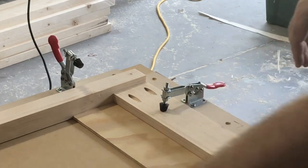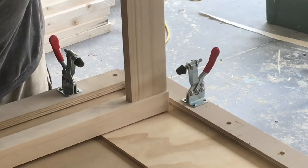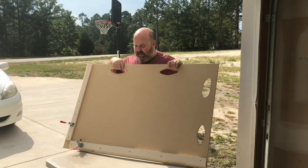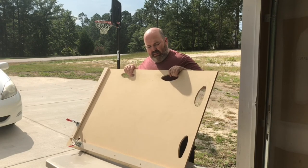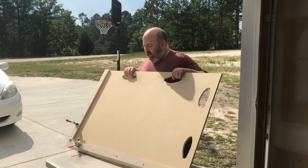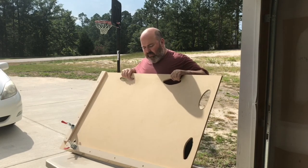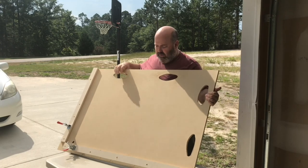Really, this jig provides all kinds of possibilities for holding assemblies together, being able to secure a 90-degree corner without constantly checking with a square — and it's not just for pocket hole jigs. There you have it: an assembly top that is portable, I can store it away in a small space, attach it to a workbench or table to assemble corners and know that they're square and secure. It's got handles at the bottom, on the side, and at the top so I can carry it easily.